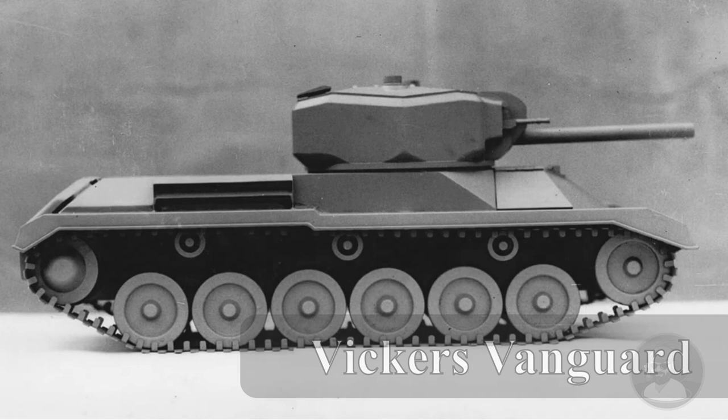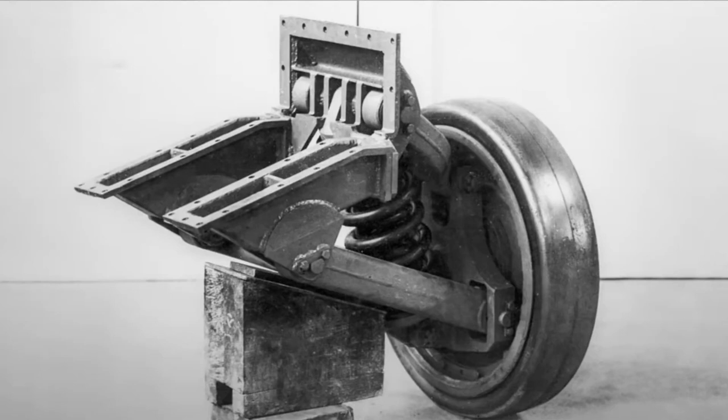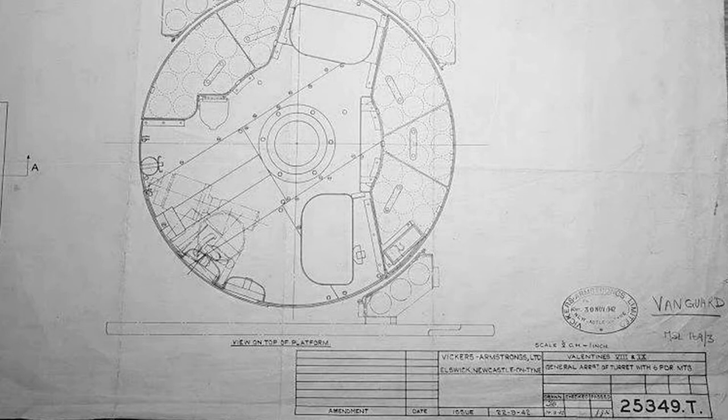What's not commonly known is that the Valentine had two sister vehicles: the Vanguard and the Vampire. The Vanguard, like many Vickers vehicles, had a V-name — a trademark of the company. She differed from the Valentine in several areas. Her suspension consisted of six pairs of road wheels per side, rubber-tyred and mounted onto independent transverse spring units each supported by an internal spring and wishbone mount. Three top rollers supported the upper track weight, and the track itself was specified as 20 inches wide and of manganese construction.